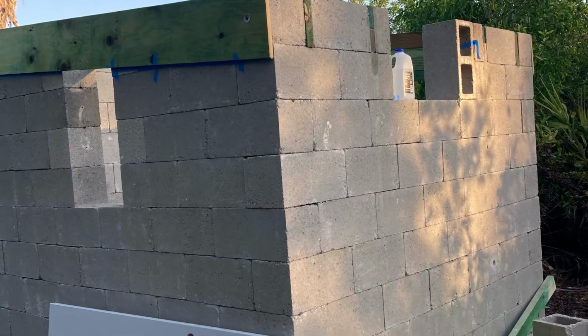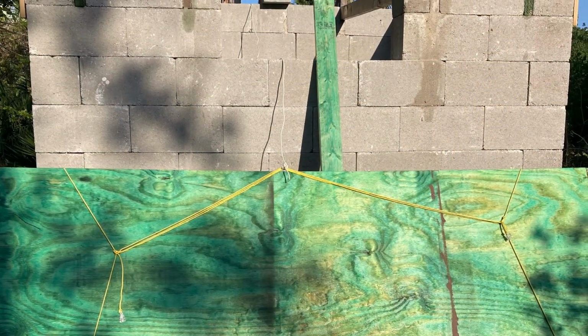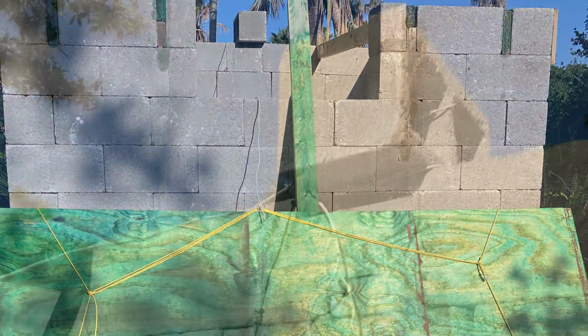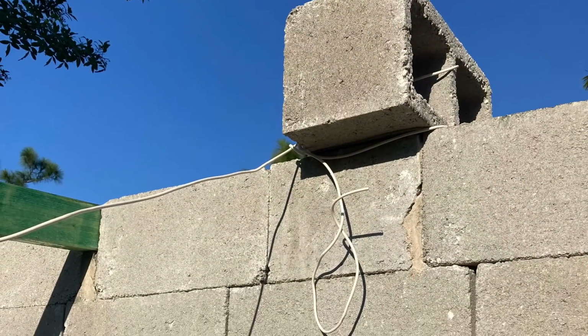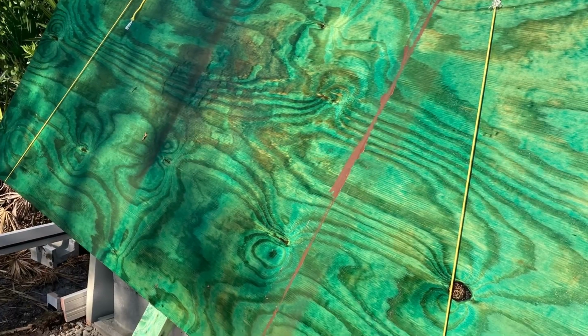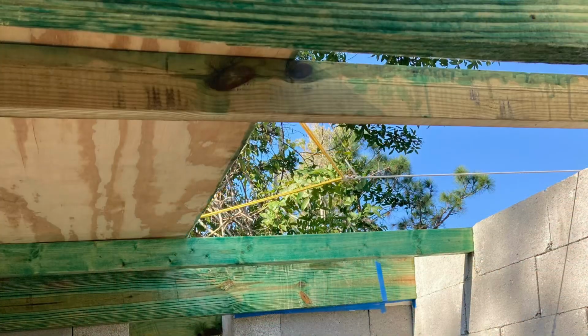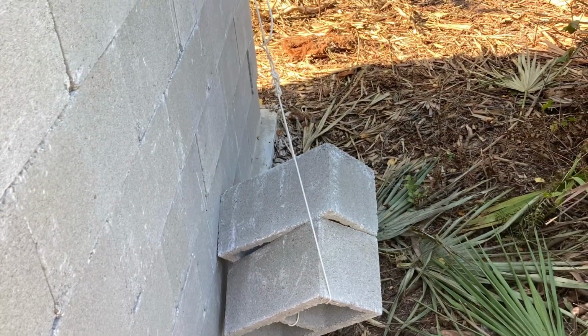To get the plywood on top of the roof, I tied my plywood with rope and I leaned the plywood onto the 2x4. I tied 2 cinder blocks, which I tipped over the opposite wall to counterbalance the board as I heaved ho onto the roof. I did this twice. I have 2 4x8 sheets. Then I screwed in the plywood into the trusses and then the metal sheets screwed into the plywood with rubberized metal washers.